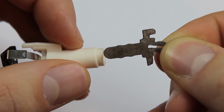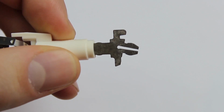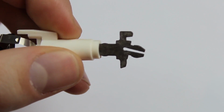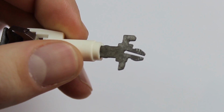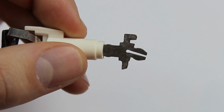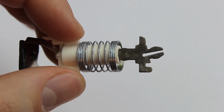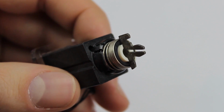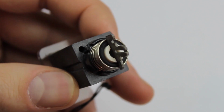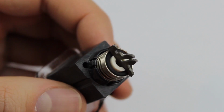First is this curiously shaped pin thing which goes into the slider. On one hand, it prevents the key from being pressed down too far, otherwise you'd push the fly plate back into the PCB, and second, it provides the mounting point for the keycap. Second is an external coil spring, which provides the return force and makes sure that when you release the key, it's pulled back up again. And third is a rubber O-ring that dampens the impact of the metal keycap pin on the switch housing. The rest is just the switch housing.